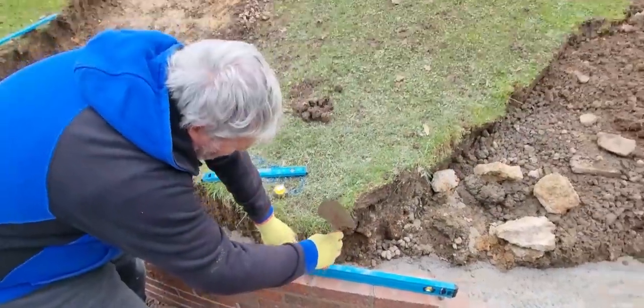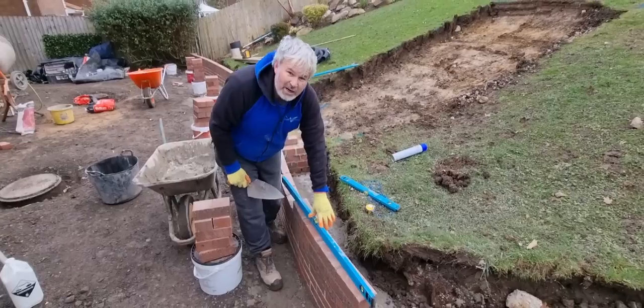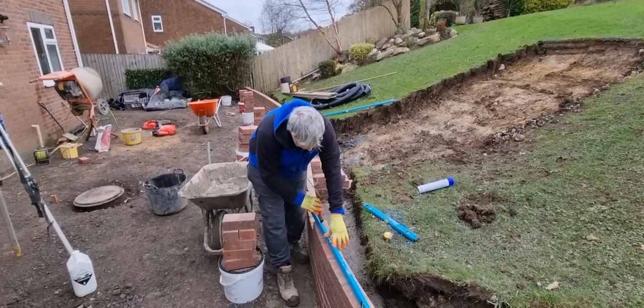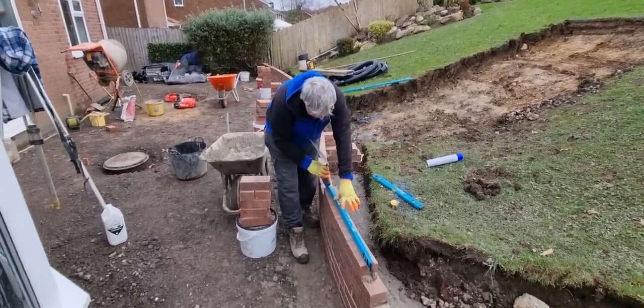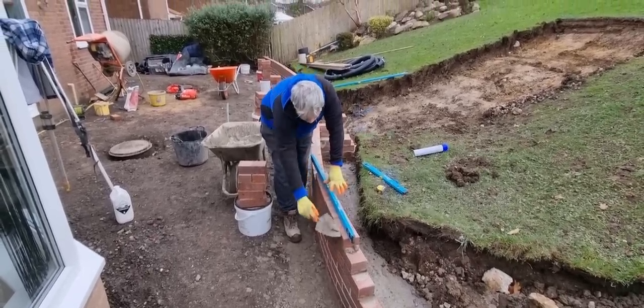So what you do is, it's a curved wall. If I start hitting every individual brick like you're taught in college, it ain't going to work. Every brick layer hits his level, although you shouldn't. That's another tip. So, little tap on your level, put pressure down on your level, so you're keeping that side on your brick, this side on your bricks. Little tap, because I did lay them slightly high. Job done.